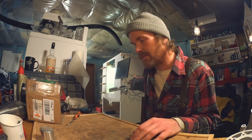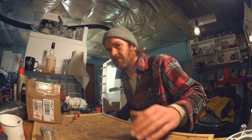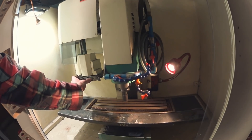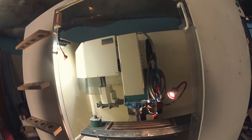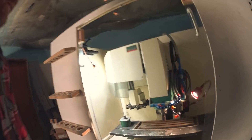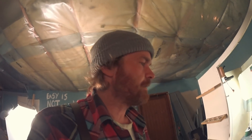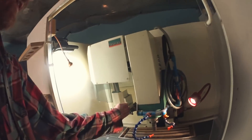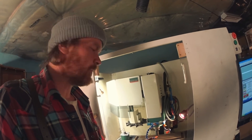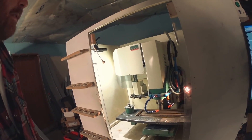I'll give you a tour and tell you about the features and the things that are wrong with it, which we'll have to fix. It seems to be a pretty sturdy unit. It has an 8-tool automatic tool-changer. There's automatic oiling of the ways and the screws, if it works. There's flood cooling. It's cast iron with thick castings, so probably better than converting one of those small mills to CNC. And it's running Mach 3.